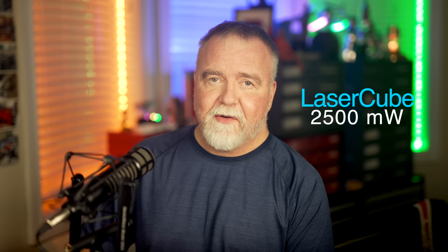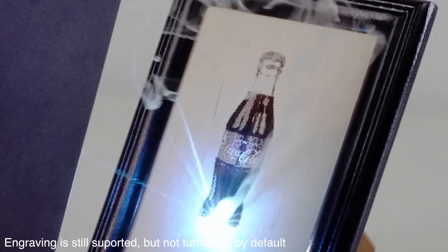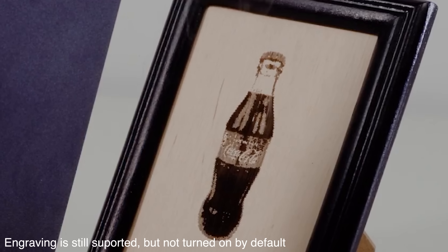The maximum safe power output of a Class 1 laser is 4 mW. By comparison, my LaserCube emits 2,500 mW — or 625 times as much as the legal limit for a Class 1 laser. That makes it a dangerous Class 4 laser capable of both blinding your vision and burning your skin. You can even use it as an engraver, although they don't really support that anymore. You might think, oh, I'll just throw on a pair of laser protection glasses. But for which color? Those glasses are all designed to protect against a specific wavelength like red, green, or blue. We have to be concerned with the entire visible spectrum, but if you want sunglasses that block the whole spectrum, you might as well make them out of wood because you're not going to be able to see anything anyway.